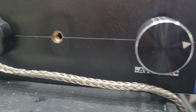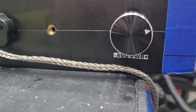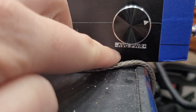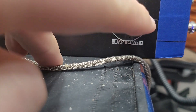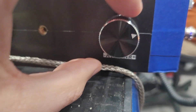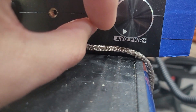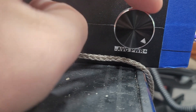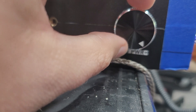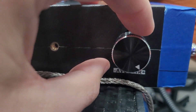This is your average power control — it's got a little label on that. It might have been better on the top, depending on where it's mounted in the mobile. Obviously more average swing to the right, less to the left. Most people get this backwards: to the left is actually maximum audio — that's the biggest sound you could ever create. The more average power you roll in, the more you take your dynamics away from the highs, and the more pinched off you could possibly be or run out of headroom.